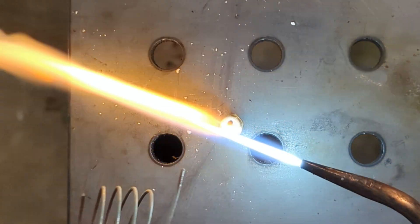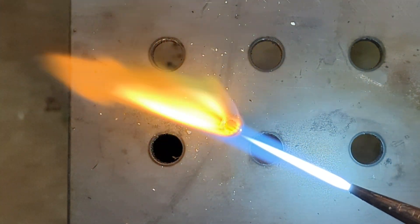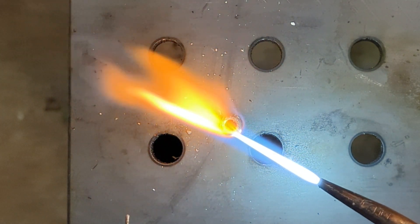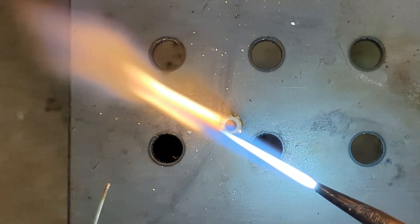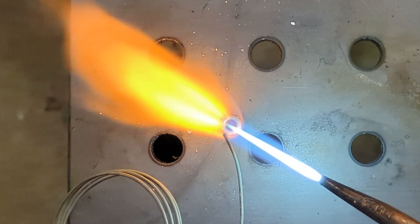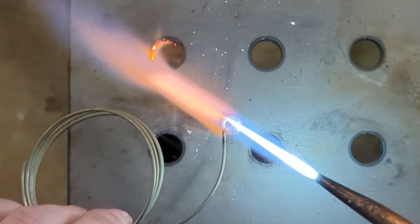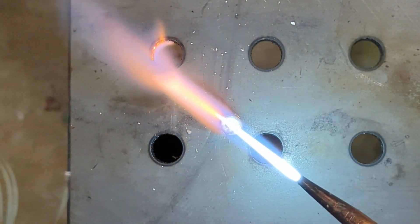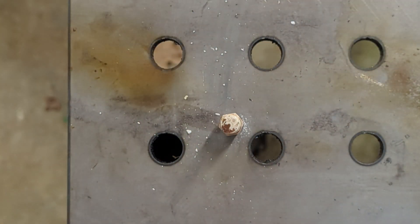What we're going to do is heat this up. I haven't done this before, so we'll see if we can just close this hole up, and then I'll drill a hole using a very small drill bit. When you're soldering like this, you put the flux on — it'll look like it dries up, almost powdery — and then right after that you'll know it's hot enough when it starts to wet itself back out. This is silver solder, but I consider it brazing because it's hot enough. Turn off the flame — and don't grab that without a glove.